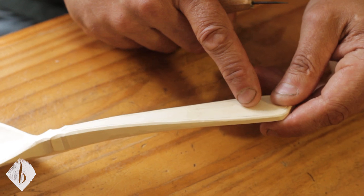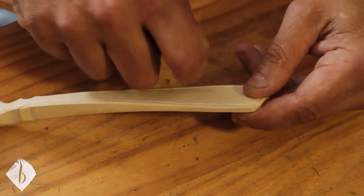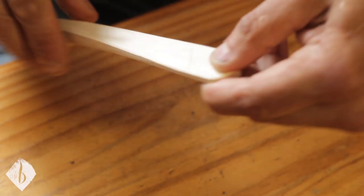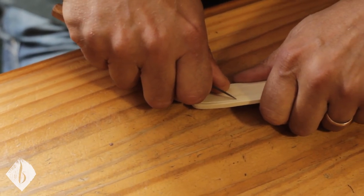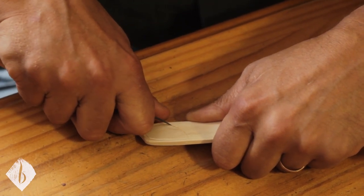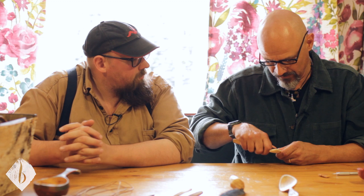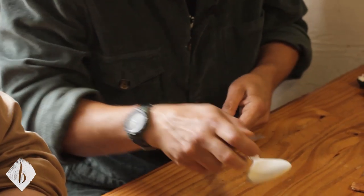The next step, when I have straight cuts down into the wood and I've cut off all the fibers, is to angle the chip carver a bit, like 12, 15 degrees, almost the same angle as when you're writing with a pencil. You try to get one long chip, so it's connected. Then go from the other way. The way I do this is I make three cuts per line. I know, for example, Jogge makes only two. He starts with the angled cut and goes for it. But I'm not that good, so I try to leave a ditch in the middle, something that kind of stops me from failing.